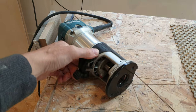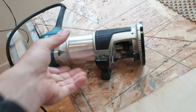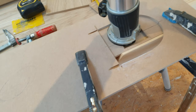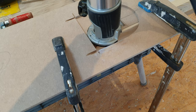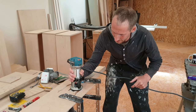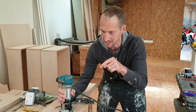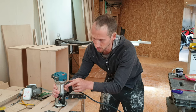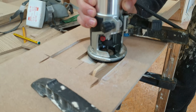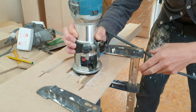The trimmer's there — we're going to get it in place, unplunge it so nothing's poking through, and slide it forward to get into position. There we go — you can see it sliding on the piece we just made, and the external part of the router is running along the top template. Right, it's in position up against the edge. I'm going to turn it on, plunge it down to 2mil depth into the timber, and hopefully follow it around very slowly. Sean will hopefully get a nice view of it. I'll lock it and just take my time.